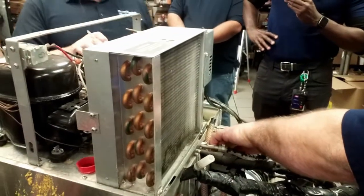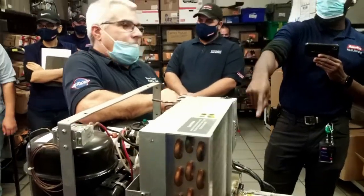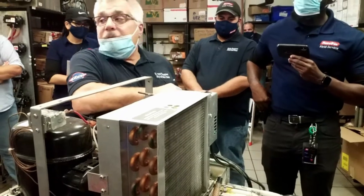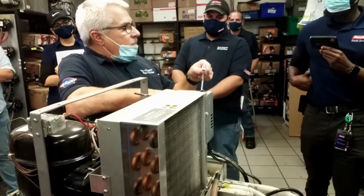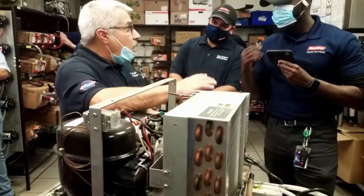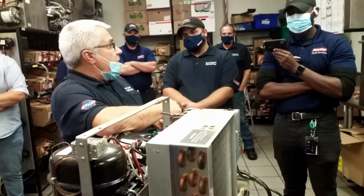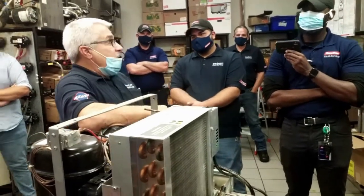This tank does go, though. Remember I asked you, called you one time, how do you fill that tank up? Well, it'll squish in. Once the water gets down below the blade on this little agitator, it'll just start sloshing it around. So if you get to one that's got no water in it or low water, it's probably not refrigerated properly. Without the refrigeration on it, that water spinning there is just going to evaporate, and you'll get nothing in.